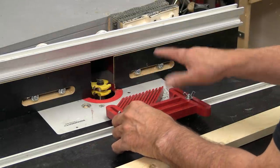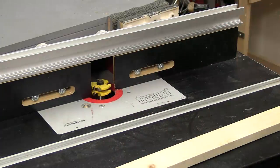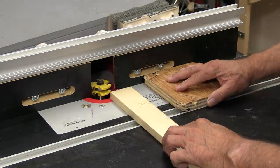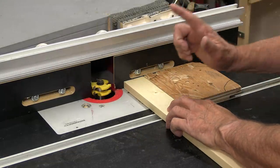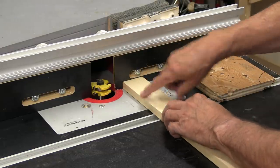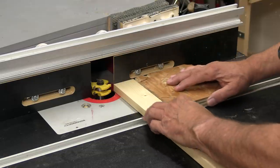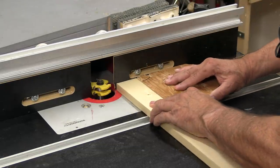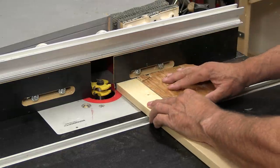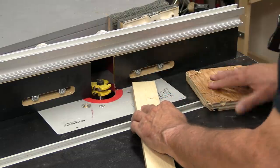You can put feather boards in that slot to help keep the wood close to the bit — that's what it's for. When we're running short grain or cross grain on a router, we use a push block. We use it because it's safe and it gives you a better cut. With a miter gauge, you often get vibration because the wood is moving, but when you have a push block you can push through, the wood is supported, and it reduces tearout. So that's what we do with a router for cross grain.